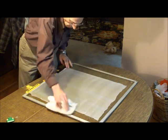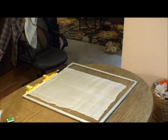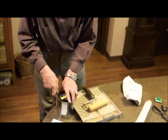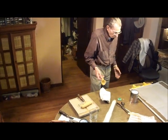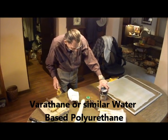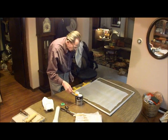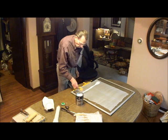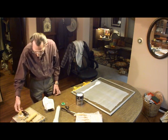The silk is just damp — there's no excess water. The excess water will dilute the polyurethane. So this is just your standard water-based poly — Varathane. A quarter of a cup I've put on there so far, perhaps.